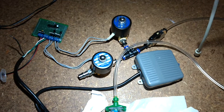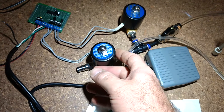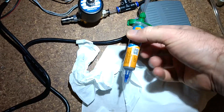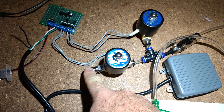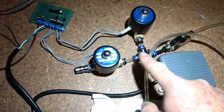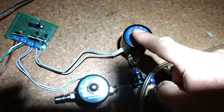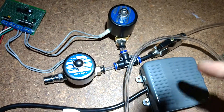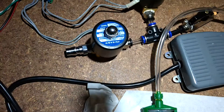At the request of a random Reddit user, this is the solenoid system that operates my pneumatic solder paste dispenser. Effectively, we put high pressure air in here, this solenoid pressurises the line, it pushes the goo out, and then this one opens when you release the pedal in order to depressurise the line so that solder paste doesn't keep oozing out.